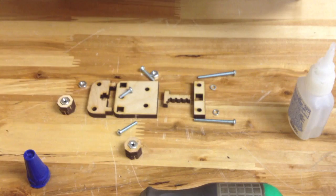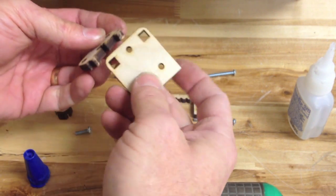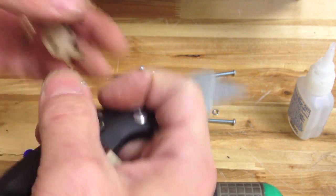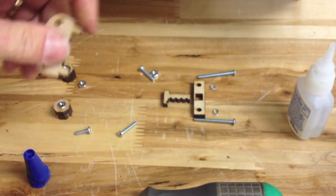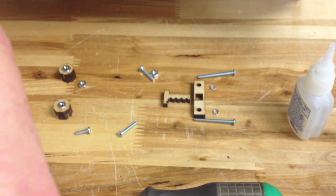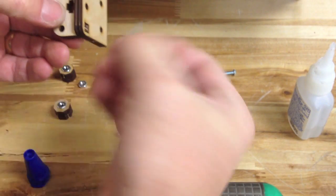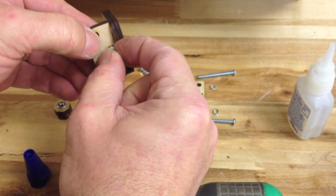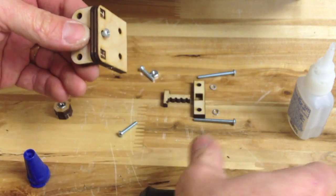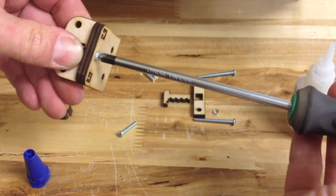This is how it actually goes together — similar to the front, but a little cleanup is required here. It's tight, but it's going to go in there, and it's intentionally tight. If they were loose, it wouldn't be as rigid. This one only has one half-inch 6-32 screw with a hex nut, so you can put this together right here before you even install it. You might hear a little squeaking and pulling while it sucks up nice and tight.